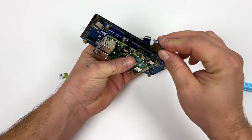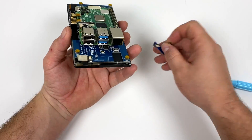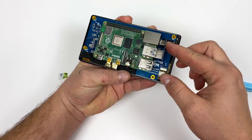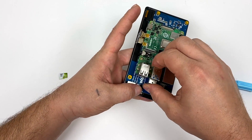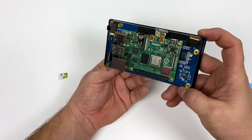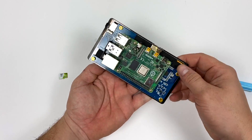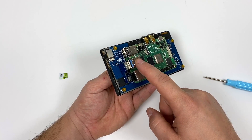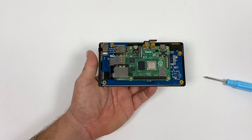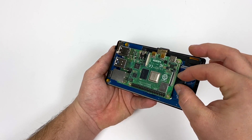Now I have the Raspberry Pi mounted, I just need to put in the HDMI adapter. It goes right to that micro HDMI, and the power and touch for the screen goes right into one of the USB 3.0 ports on the Pi 4 and the micro USB port marked 'touch' on the screen. When set up this way, all we need to do is add power through the USB Type-C connector on the Raspberry Pi 4 — the USB 3.0 port on the Pi 4 will then power the screen and activate touch. No drivers are required for this screen but you will need to set up the config.txt on the SD card. I've already done that with the card I have here flashed with Raspbian.